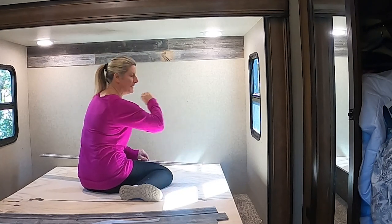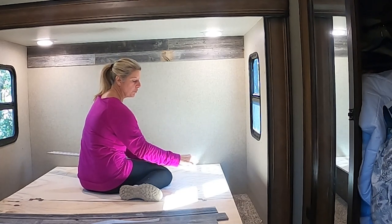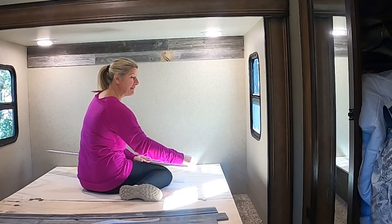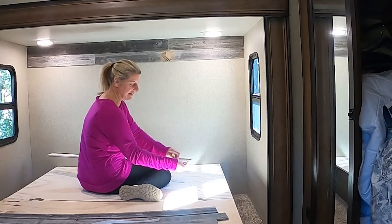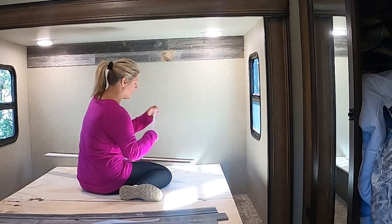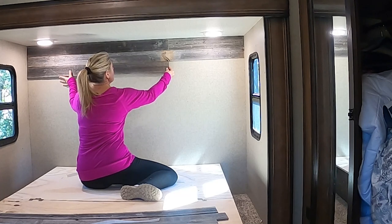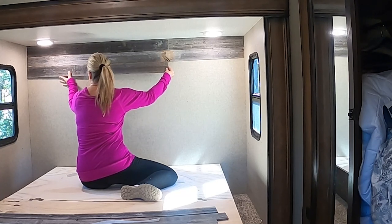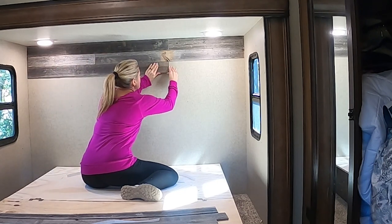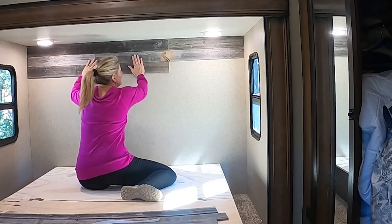What I am seeing on these a little bit — and it's just because it's old wood — is that some of them are kind of bowed a little bit. So what you're going to want to do is drop it down and see which side is going to want to bow a little bit more. I'm attaching the one side that fits good, and then on the other side, I'm making sure that I don't press it yet until I can push it up into place. I'm going to let that go ahead and be touching, and then take this piece and push it up where I need it to be, and then push it in — it holds in good and keeps it flush.